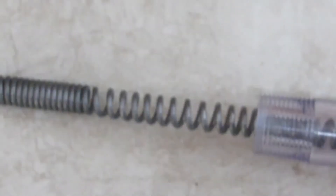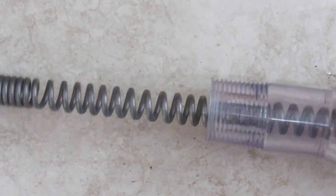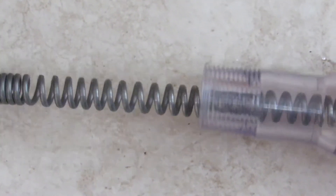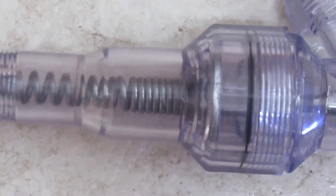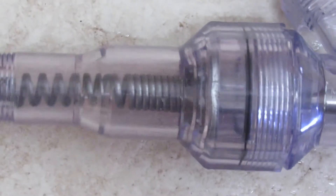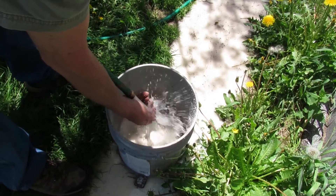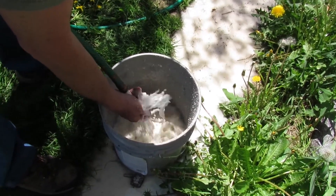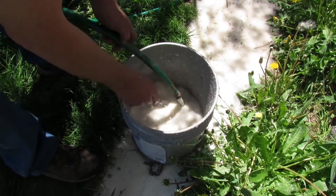High pressurized flowing water shooting out the end of your dip tube quickly sweeps the suspended chunks of sediment to the mouth of the tool. This pressure forces the chunks up against the spinning auger. The auger busts them up, pulls them inside, and prevents plug-ups. Once inside, the sediment is ground further in the grinding chamber with the water to produce a fine slurry that is discharged out through the garden hose to a remote disposal location.